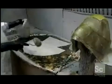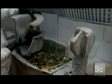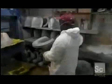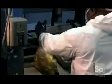He drapes them over a mold that's been made from the plug and smooths the material to eliminate air pockets as he continues to layer and glue. He's laminating all the pieces together to form one. He trims away the ragged edges and then places the inside portion of the mold into the outside one. The wet fabric is now sandwiched between two mold pieces.